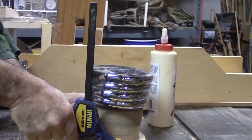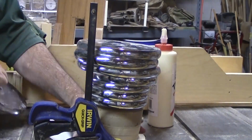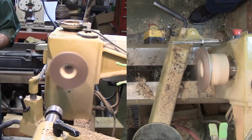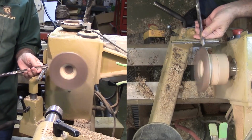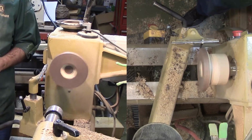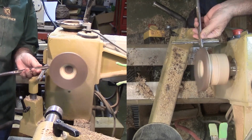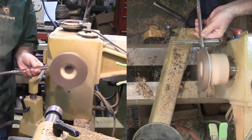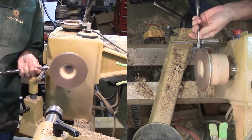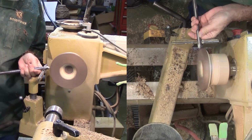However, the lopsidedness is starting to take its toll. All of the weights slid off onto the floor and had to be replaced. Now for a trip to the lathe. For now, all I want to do is to trim the outer perimeter to be round. I don't want to reduce the diameter, as I need as much wood as possible to clamp the next rings. I know that I'm pushing the glue set time. It had an hour, which is enough to turn just a little under light pressure. However, some of the excess squeeze out is still fluid and spins out with centrifugal force.